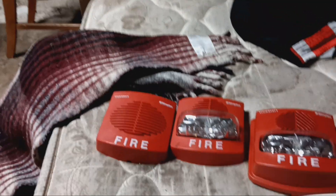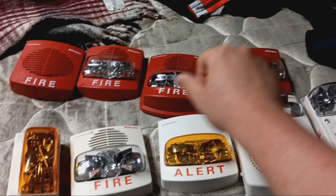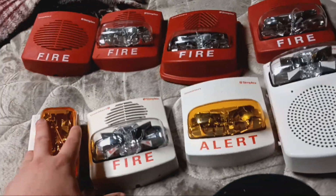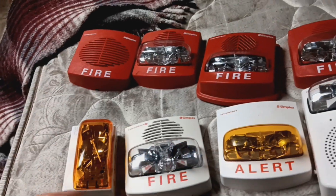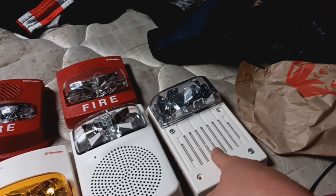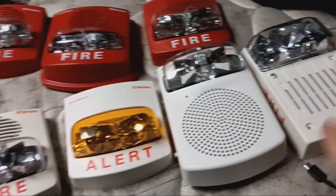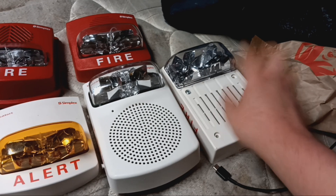With the free-running models you don't get any handicaps. With SmartSync you're only handicapped by the sync protocol to a lesser degree, whereas the addressable ones are a complete handicap. Some of these will work on the TrueNAC addressable controller. This one can only run on TrueNAC. This one will only work on IDNAC. These three are cross-compatible with IDNAC and TrueNAC, so you can use them on a TrueNAC addressable controller. You cannot use the 4906-9206 on a 4100 ES with an EPS or EPS Plus, or a 4010 ES with an ESS or enhanced system supply, or a 4007 ES with IDNAC. It will only work on the 4100U and the 4100 ES with the TrueNAC power supply, the 4009 TrueNAC remote power supply, and the TrueNAC addressable controller.